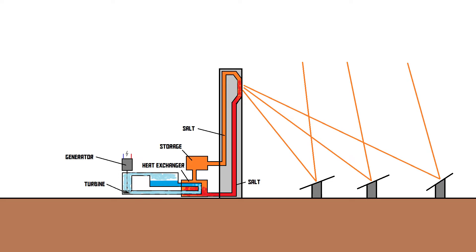What's happening in this tower is that the salt stores the energy, then transfers it onto the water. If a cloud moves in front of the sun and less light is shining onto the tower, so we're not heating up as much salt, that doesn't really matter — because there is enough energy stored in that very hot molten salt to just keep boiling the water and keep the generator running at its normal speed. Even when it's night, there is still so much energy stored in the molten salt from during the day that we can still keep boiling water and therefore keep generating electricity. So this kind of solar power plant is capable of delivering very stable power to the grid because it has this built-in buffer system — it's kind of like a battery.